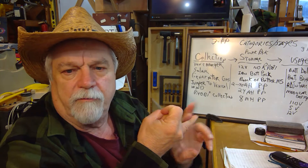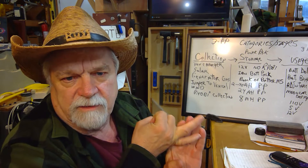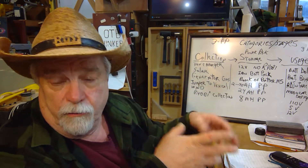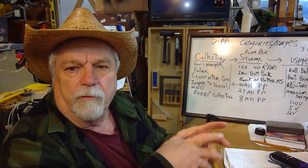The unit itself has two batteries for 70 amp hours. I have an inverter on there so I can get 110 and 5 volts out of it, and it has a battery charger so I can recharge the batteries while the power is on, or a trickle charger to maintain a charge over long periods. It's ready to go when I need it — it's a good setup. But I've learned some things from doing this, and I've decided I don't really have to have that battery charger on the cart itself, other than it being convenient that the unit is all self-contained.